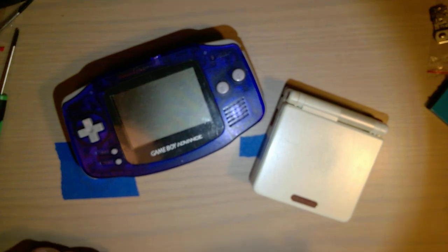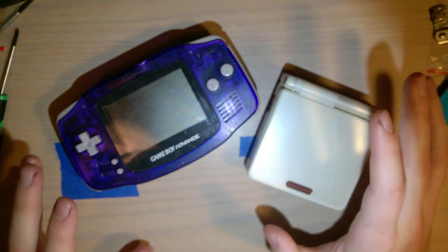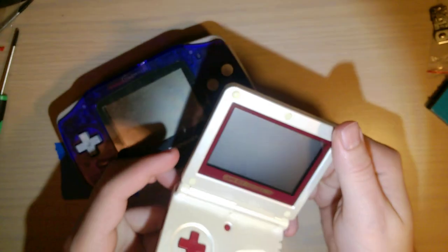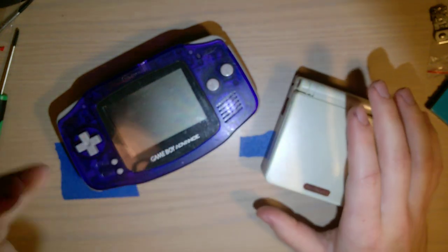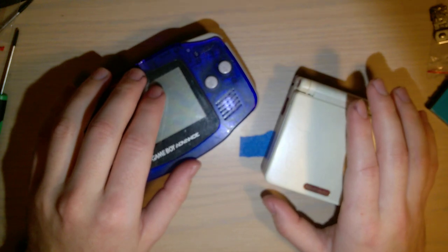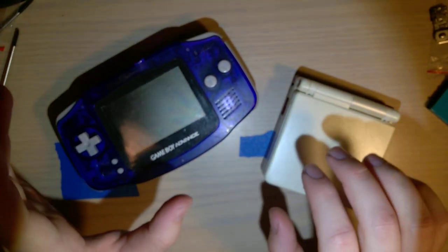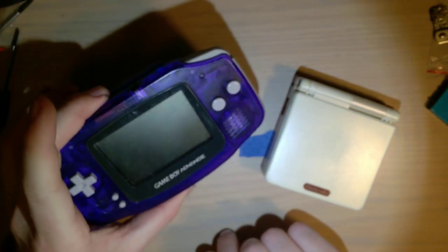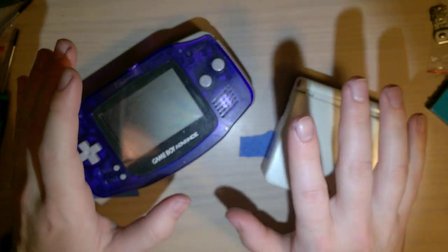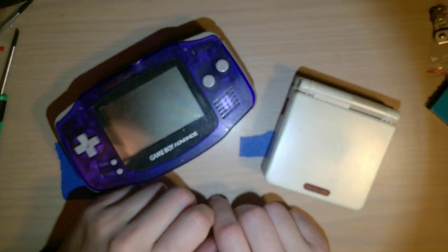Sometimes there's a little bit of wonkiness. In this case, for my Game Boy Advance SP, it just means the colors are a little bit more washed out than usual, which is especially noticeable with the frontlight. A lot of 40-pin backlight mods in particular for Game Boy Advance consoles tend to be a little bit washed out — or 32-pin — and you see a little bit of lines going across the screen. They're interlacing artifacts.